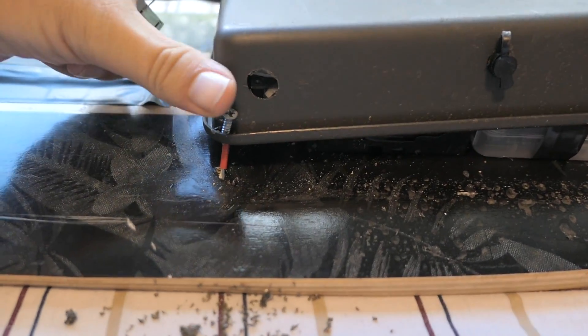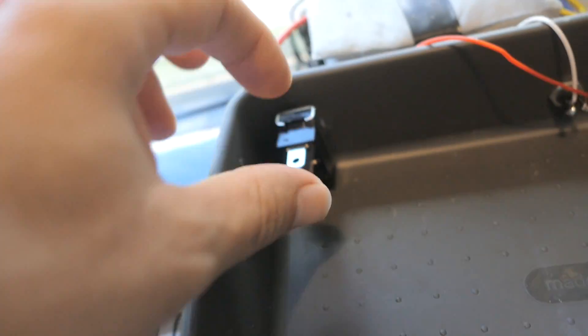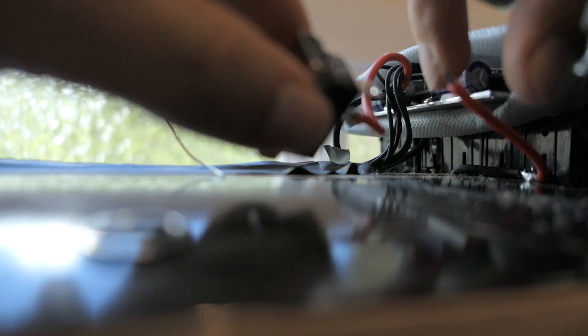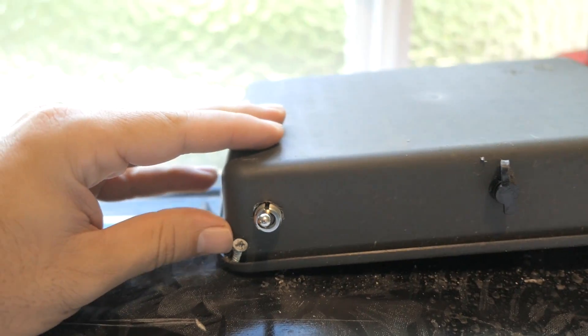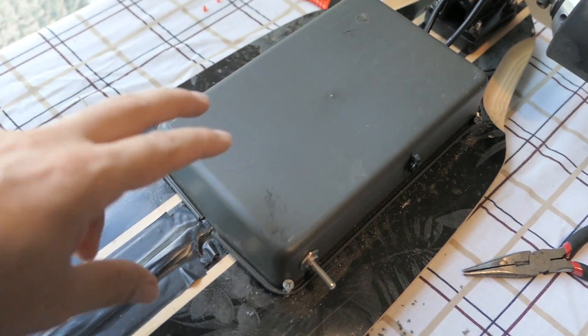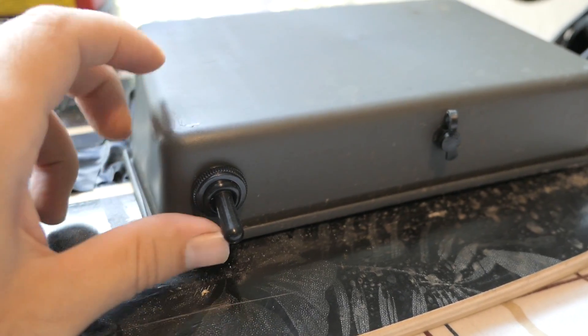The hole is in - I had to wallow it out because I didn't have a large enough drill bit, so it's a little crooked, but that's no problem as long as the switch still fits, and it does just fine. We'll put washers on that side and we'll have a switch. Before I do that, I'm going to solder the cables. That's one side there, and now the other side. I'm going to flip this around, put the switch through here, and orient it so when it's up it's on and when it's down it's off. The switch is in and pretty tight - I'll tighten it and put the rubber weather seal piece on. The enclosure is tight now and that rubber piece is on, nice and tight - so now we've got a nice sealed button.